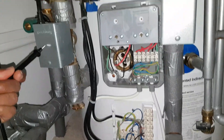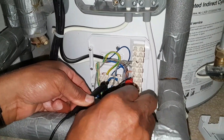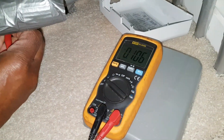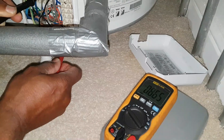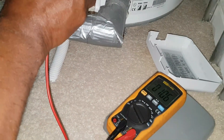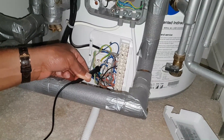One reason it's not activating is because the motor hasn't been told to open. This brown wire tells the motor to actually open — that's the one coming from the heating. There's another brown for the hot water. Neither of those is getting signal. So all we're getting is the permanent live coming in — nothing else. It looks like there's no power coming from the timer.